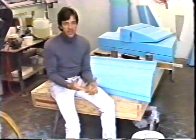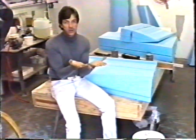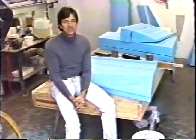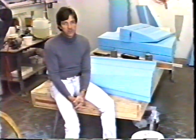After you get done with the sanding process, pick them back up again and check both surfaces with a straight edge to see that you end up with a straight core without dishing on one side or a high on the opposite side. Carefully assess this before you go on beyond the sand out section of this tape.